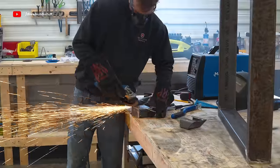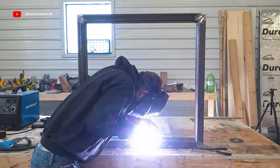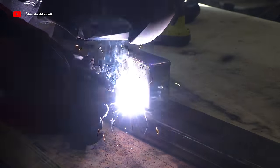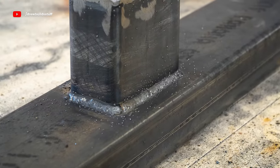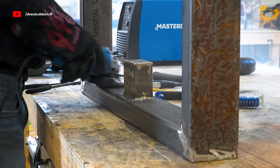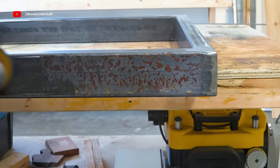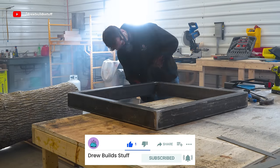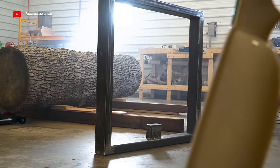After giving it a good grind, this piece sits right in the middle of the bottom section of my leg and I'll weld it into place. I measured it so the log sitting on top is suspended right in the middle of the square opening. That's one leg fully constructed. Now I'm taking a 120-grit sanding disc on my angle grinder and going over the entire thing to remove any final imperfections and rust and make it smooth and ready for paint.